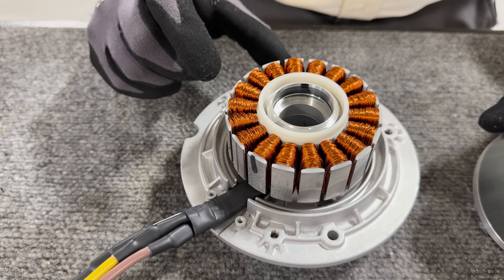So it's just a size and power difference. The torque capability is very different. This brushless DC motor is also much more efficient than the induction motor. So with improvement in efficiency, improvement in power, and improvement in size, you end up with the brushless motor actually being lower cost — even though it has neodymium magnets, which are expensive — because the induction motor has so much copper, steel, and aluminum in it, plus the cost of integrating something so big and heavy into your product, that it ends up being more costly.